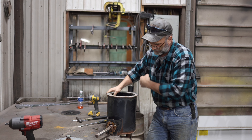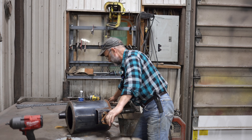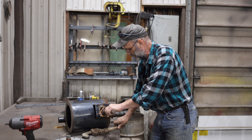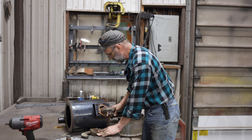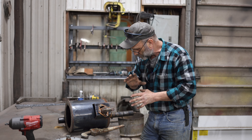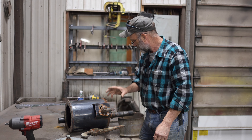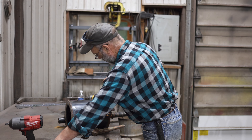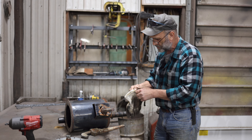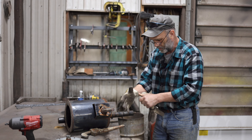Not sure what we would have done without cordless tools today — this makes life so much easier. Now I've got that whole shaft loose. If you look down inside, you can see the bearing retainers and all that stuff is loose. The bolts are all loose — this whole shaft is floppy. Next thing I'm going to do: these shafts come back out through this way. I'm going to cut this bearing off. I'm going to position it so it stays in one place, just kind of support it there and keep this thing rotated up.